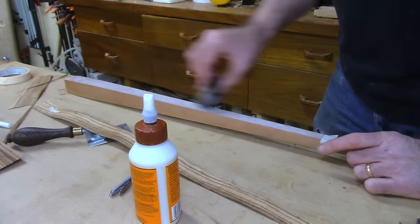Well, you can see why clamping is an advantage — because you end up struggling with the piece going around on you. Always good to be able to feel confident in the stability. I might have a piece of tape. See, this is one where I forgot the tape — so let's lift this up. It's not a problem because the tape protected everything from gluing in, and I'm just going to lift the veneer the same way — it pops right off.